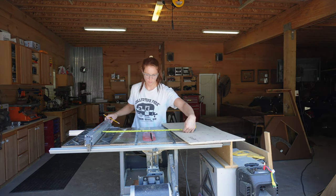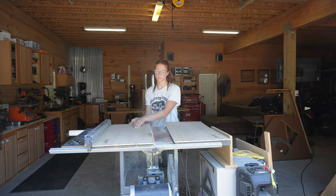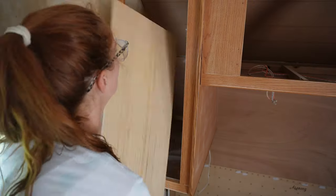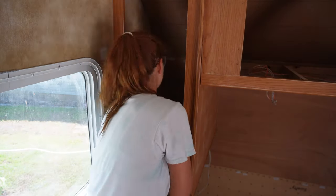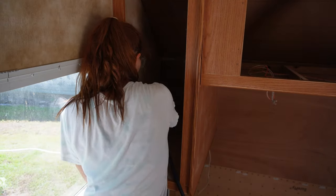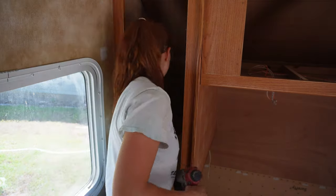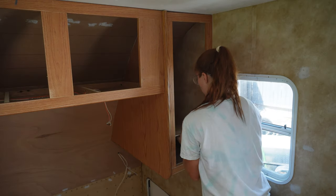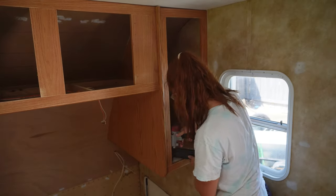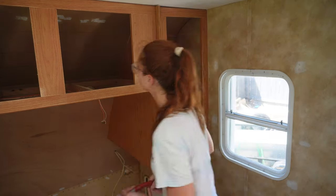Because I have two sides, I'm making two pieces here that will be identical, because nine times out of ten, unless you put it back wrong, the sizes will be the same. Y'all don't fuss at me for having my blade too high — it was too late before I realized it was too high and I just didn't care. Anyway, I put these in and they fit perfectly. I basically just slide them in and push them up, because there's framing underneath. You kind of just scooch it into the little half-inch gap where the framing is. If you've ever done this, you'll know exactly what I'm talking about. Then I just put some crown staples in to secure them down. And that's pretty much it.